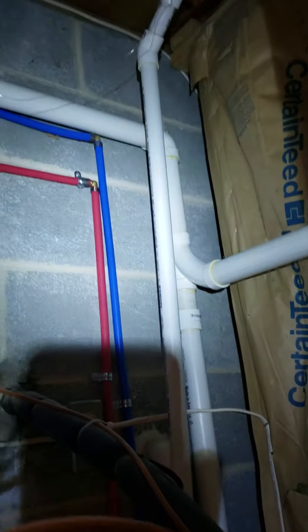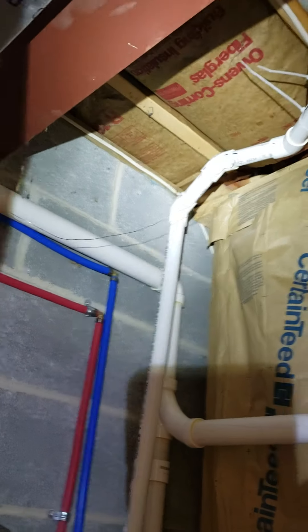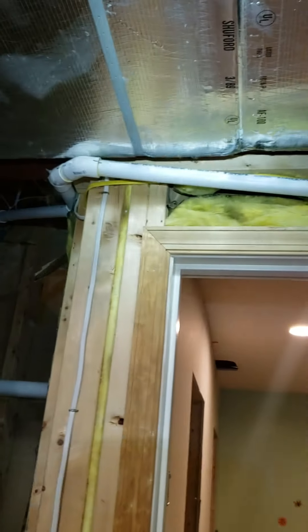You've got to have it tied in with the vents so the water doesn't clog. So I have that going up there, going all the way over here, turning up, and tied that into vents from my other toilets — no big deal. Got to have a good vent going to the outside. And then here is the one-inch on those 45s. I'm not a plumber, so I don't care if it doesn't look good, but it's on a downward slope and that's all that matters.